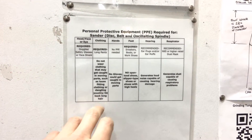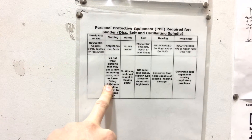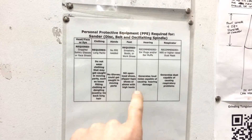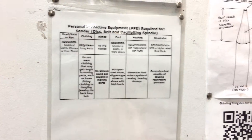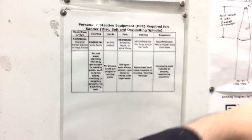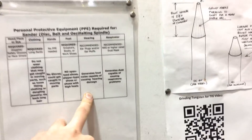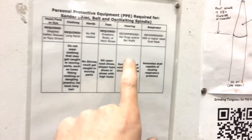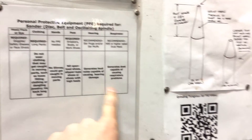You're also going to refrain from wearing any gloves. You'll want to wear some long pants and some closed-toed shoes, preferably steel toe in the metal shop, so we've got some protection for your lower extremities. I like to wear fire retardant shirts too if I'm making a lot of sparks. Hearing protection is a good idea as well — it generates a lot of loud noise.